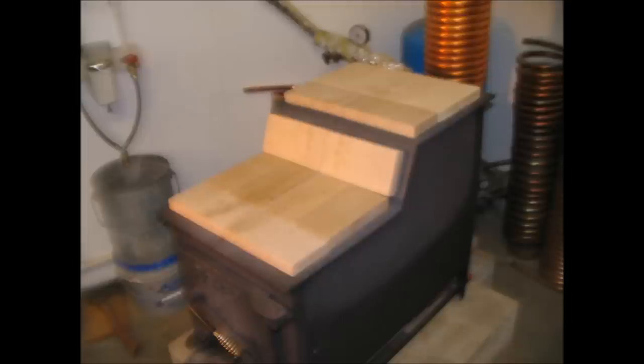I've done a couple of mods on this stove with the intent of raising the temperature in the firebox to make it burn a little bit cleaner and hopefully a little longer. The first is super simple — you just cover the top of the stove with firebrick. The firebricks also seem to retain the heat a bit longer after the stove goes out.